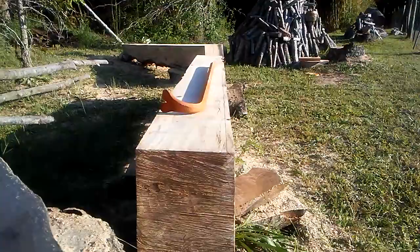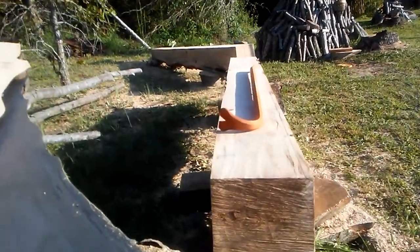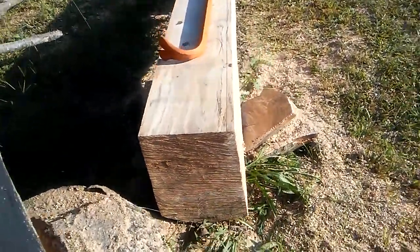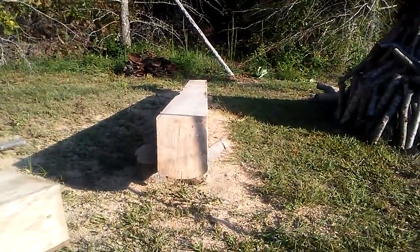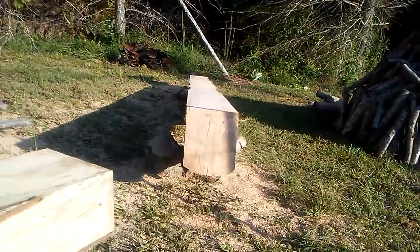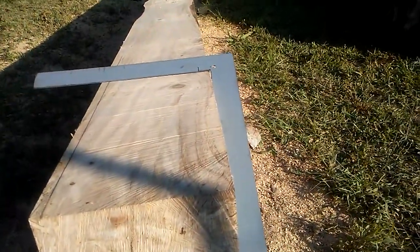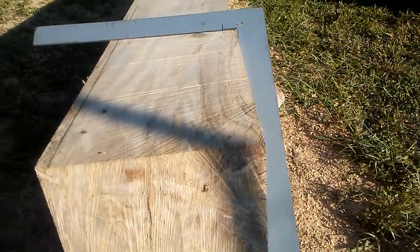Check out that straightness. That's a $30 mini mill — that's what I refer to it as. It's an edger, it's a knock off. Look at that — that ain't bad for rural work. That's 8 inches wide. Here's another one, same thing. Notice the straightness — straight as a gun barrel. I'm going to mill all this into 2 inch thickness with an Alaskan. I've got my framing square right here. I showed Doug some of this earlier. Not bad for a chainsaw, ladies and gentlemen.